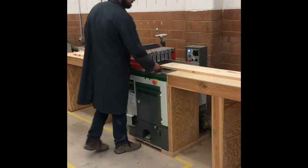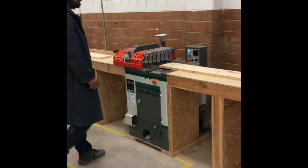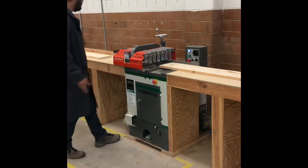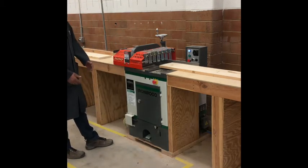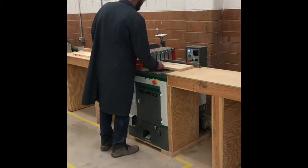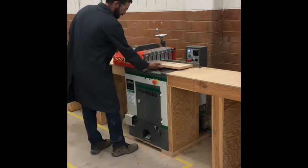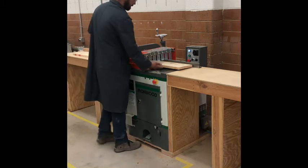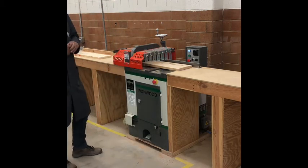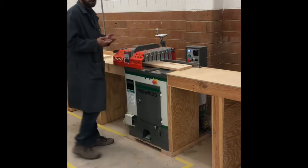As far as safety, keep your hands off the saw when you go to cut and make sure you're not reaching under. The only injury we've had on the up cut saw: I had a student in my second year class who had to cut about five boards at 14 inches. He's sliding his board through — he was in a hurry, and we should never be in a hurry — and he had his finger underneath the board. He stomped on the pedal, the blade guard came down and clamped the board, and pinched his finger. Pretty minor — he pulled it out, had a little skin taken off, just needed a band-aid.